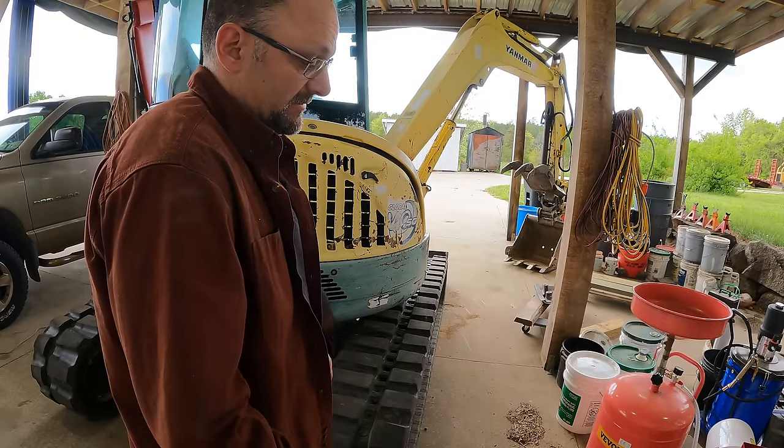I tried turning that horsepower control up. I went a full turn on it, and it really made very little difference. It might have made me go 2 seconds faster on the tracking, but I was still going 2.5 miles per hour. It was not getting me close to spec, and I didn't want to go a whole lot further. That said, I don't hear the engine straining a lot. Maybe I can continue to turn that in until I'm actually getting some results.